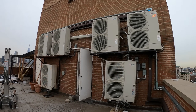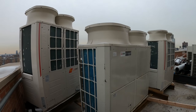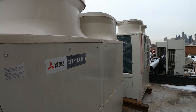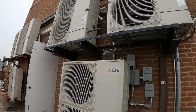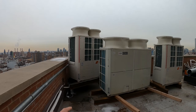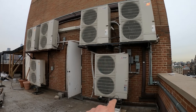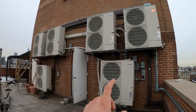Well, we got the same issue with indoor temperature detection for these units as well, but there is a difference. I will leave a link in this video's description. Changing the indoor temperature detection for a system that has a City Multi outdoor unit is completely different than one of these units which is a PUZ series — interesting because they have the same indoor units but because we have a different outdoor unit, changing those settings are different. For the City Multi we had to do it through the indoor board for each blower, but from what I remember these are done through the thermostat. Check out that video because that's important when you run into that situation, and let's see how I'm going to change it for this one.